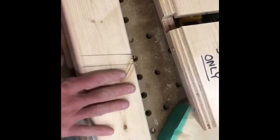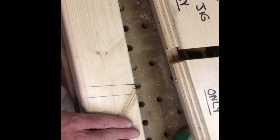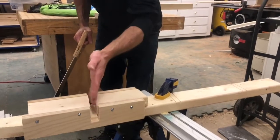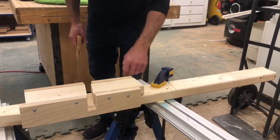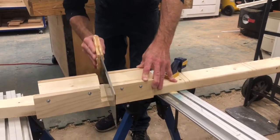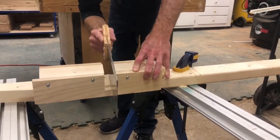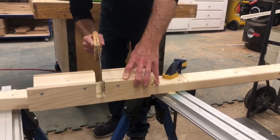This one's the jig for the right leg — so if you're facing the finished product, this is the right leg — and then the left side jig would be for the left side. I have the back saw here, trying to use this jig, and my goal is to line the saw up right here on the sides of this jig. I have it clamped down to my work surface and I'm really trying to go easy — it will cut best if you're not applying very much force. I'm just trying to go nice and easy, keeping it flat up against the jig so I have a straight cut.